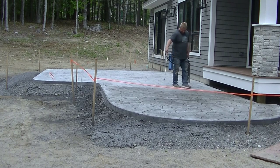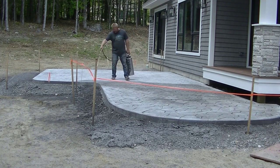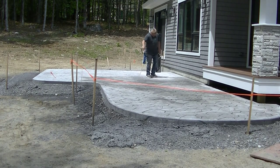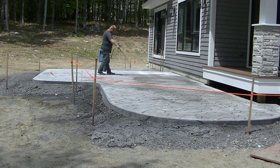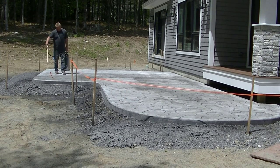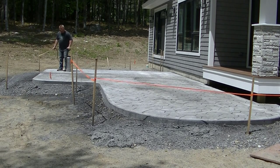The colors are going to stay looking darker. It doesn't take long to put a coat of sealer on 600 square feet when you're putting on a nice thin coat. If you're going to put three of them on, you're going to get it covered really well. You've got to keep it pumped up to maintain pressure. Foundation Armor sealer is a really good sealer — that's the one I recommend for stamped concrete. I'll have a link for that down in the description, and that sprayer too. We've had that sprayer for a couple of years and just keep it really clean every time.